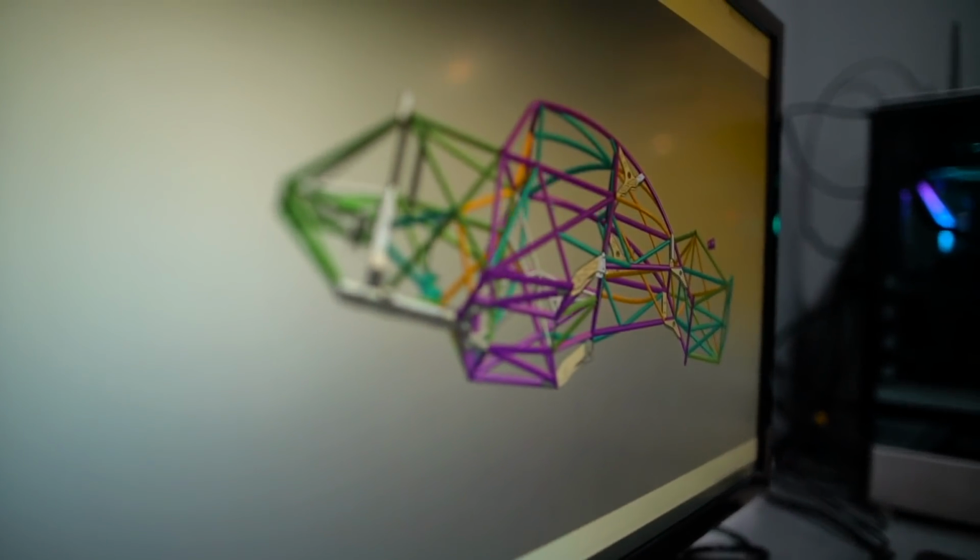Assembly, that's going to make it very easy for us. Yes. Also, we'll definitely be heavily referencing this drawing as we assemble the whole chassis. Like we mentioned earlier, we have part numbers laser etched on all the tubes, so I can come back in here and match everything up, and we know where everything goes. There's no questions, and there's no guesswork.